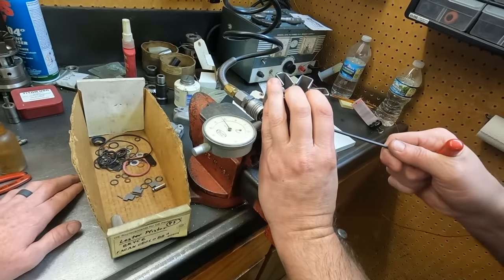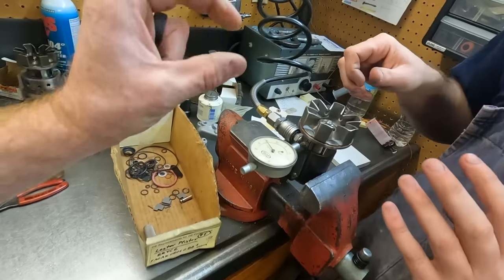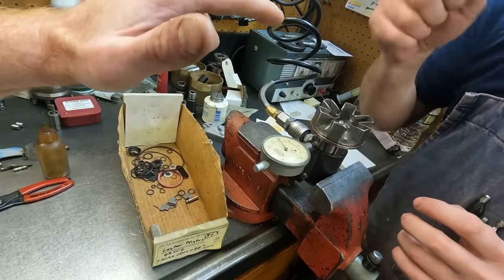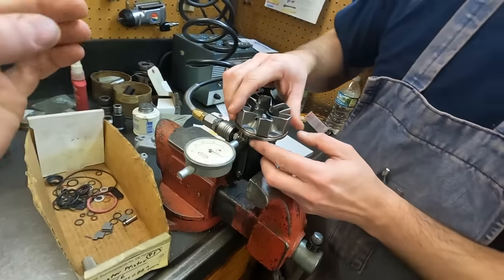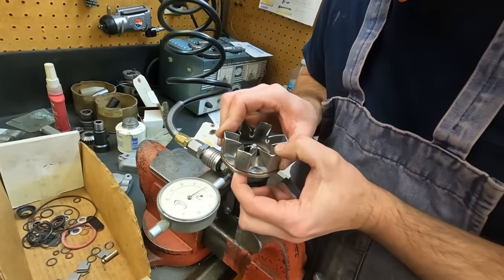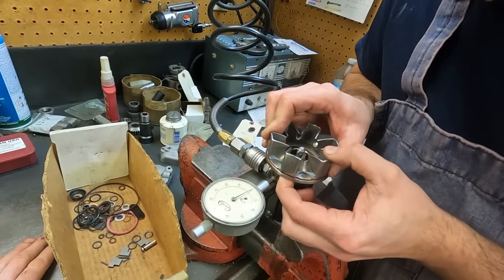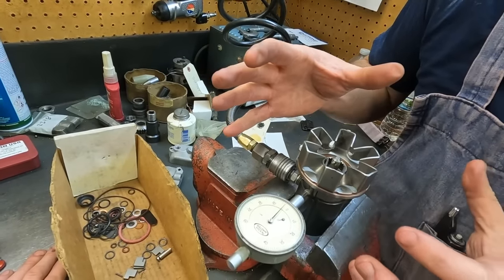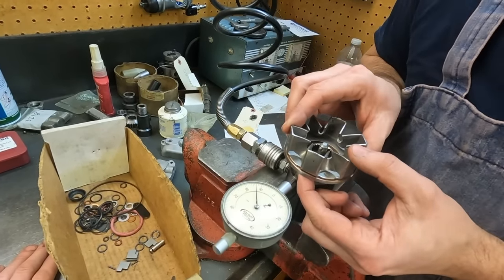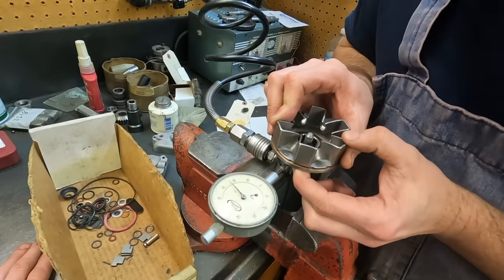And normally, whenever you adjust these, you want to adjust. What is that clicking? Is it a setting? Just because the screw is tight. Oh, okay. So it's not like a setting. No. And so as we turn that in, it lets the rollers come out further, then you have to re-zero. You have to find a new zero and then measure from there.